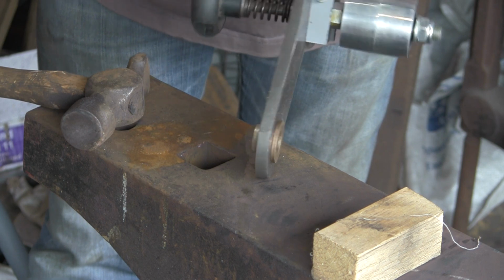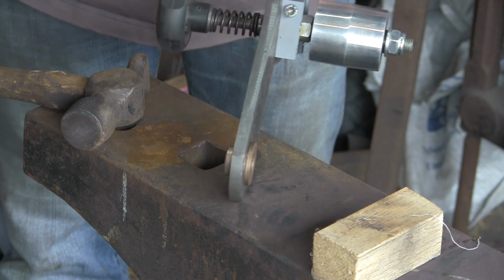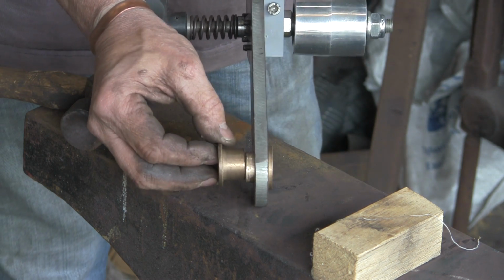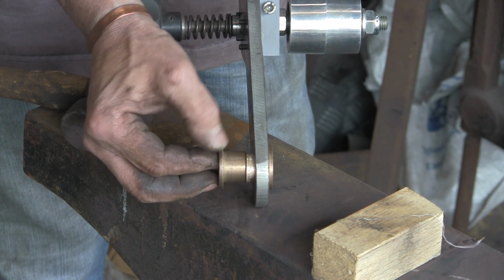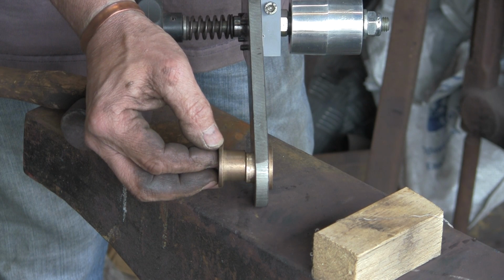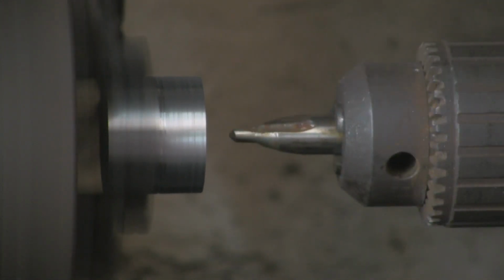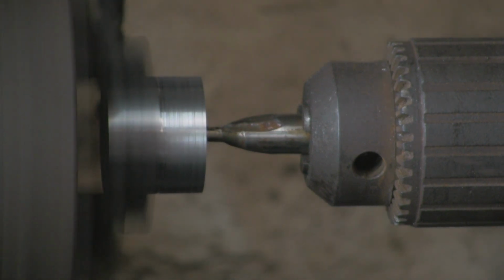So I'm hoping that distance, that shoulder, is going to be just enough to get the roller in the right place. If it's not, I will probably put a little spacer in there, another bush to join it all together. If the roller isn't in the right place, I shall probably just do what I did on the other rollers and skim a nut down or put another washer in, rather than mess about with these bushes. Once they're in and this close, I'm not going to start mucking about.